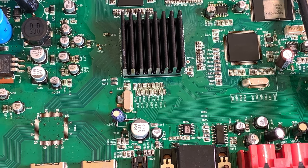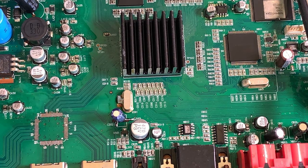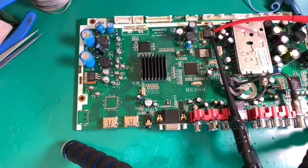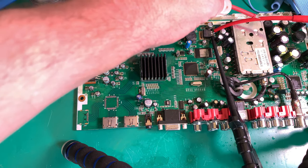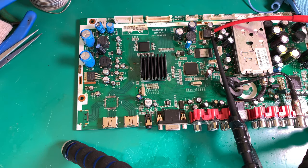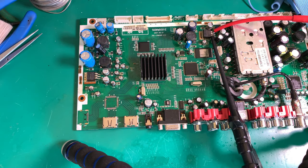I actually had a closer look, and this forms some sort of RC timing circuit, and it's got to do with that crystal. So for that chip, yeah, I suspect that. What I'm going to do is zoom out a bit. What you can see, I've got these two leads hooked on here. That's a low dropout voltage regulator. It's an AZ1084 for those of you playing at home.